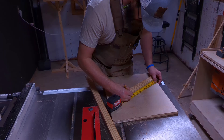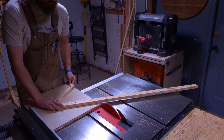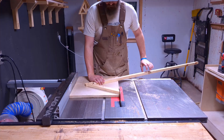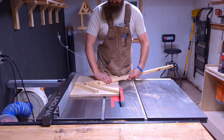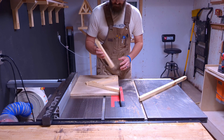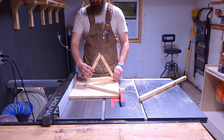I want to screw the fence onto this. Here we have a woodworker screwing down a fence for a jig. He will use that cut-off and butt the 30-degree angle previously cut against the fence he just installed, then cut off the excess. That completes the down-and-dirty jig. Testing it — it just works out perfect every time. This will increase your speed, decrease your work time, and make the shop way more enjoyable.